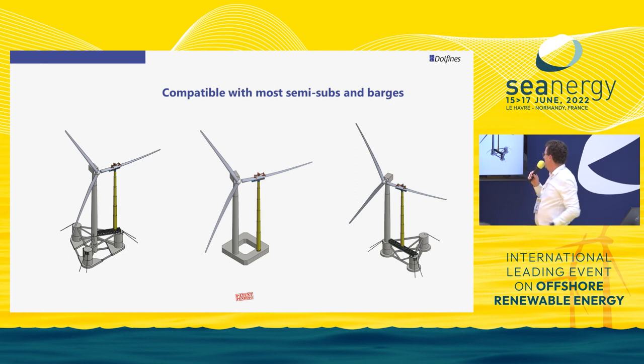One important point: once you have landed the different parts, you tilt or trim the floater slightly. So before telescoping the system up, you need to counter-ballast the other compartments to bring the system back to horizontal.